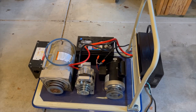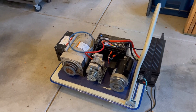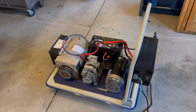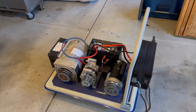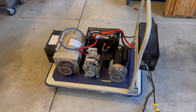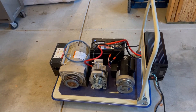So that's video five. I'm going to have to buy a gear reducer — I did not plan on the generator causing that much torque demand. That makes sense as to why they say you need an 18 or 30 horsepower motor for certain size generators, because you need the torque. There's really no transmission in between, so like a car, to get the torque you need from the engine you have to have some type of gear system in between. That's where I'm at, and it's going to take some time to get the money for that gear reducer at six to seven hundred dollars from McMaster-Carr — a lot of them are 1,750 RPM input and I need 3,600.